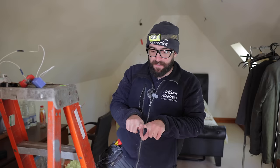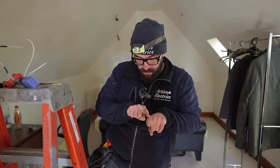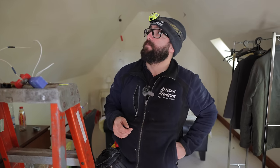accumulation of the resistance that's making it go down, or whether the cables are clipped together or stacked on top of each other, so that when I'm measuring it, when they're connecting, the live from that one is going down to the earth of the other cable, or vice versa. Yeah, without actually seeing the cable, it's a bit difficult.